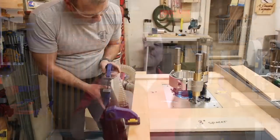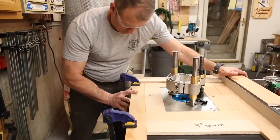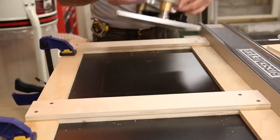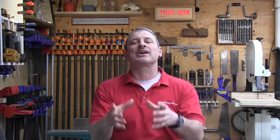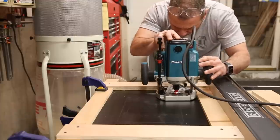We've been using templates within woodworking and carpentry for years. They minimize tedious measurements and layout. My plan was to create a template to first cut out my rabbet, which would support the router table insert, then add spacer strips to move the router bit inward and cut out the center portion of the table so I could drop in the router. The router would drop through the table and the plate would be flush.